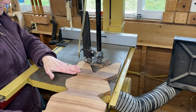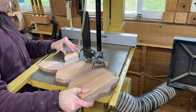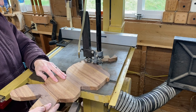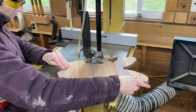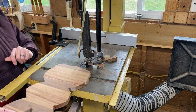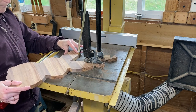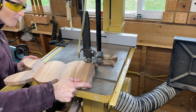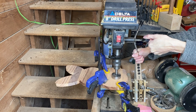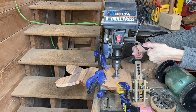The holes that I drilled in here do make this part a lot easier — I can just go right into the holes that are preset and it helps with those curved areas. Now for the cute little bunny butt on this design, you could do this a lot of different ways: you could use a wood inlay, you could also cut a hole and put in something like marble or a different material. I prefer to use epoxy just because it's easy to pour in and you don't have to make sure that the inlay you're cutting is exact. To cut the hole in the tray I used one of our old drill presses and I had to feather the bit to get it to work — I'm just using a two-inch Forstner bit.